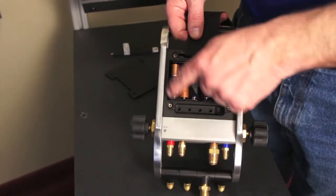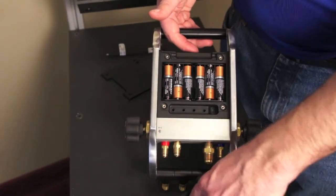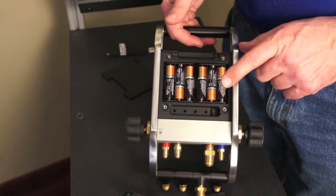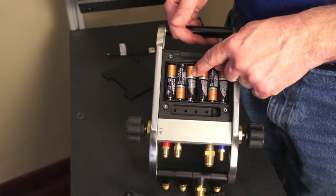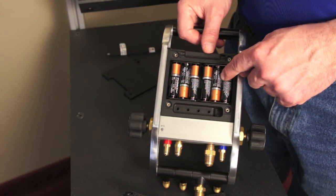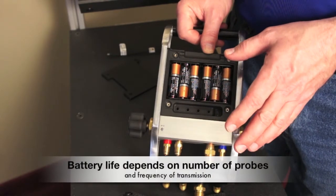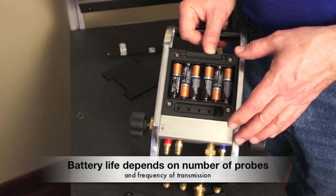After removing the four screws in the back we get access to the battery door of the iManifold, where we can take the hook out or change it by sliding out the rod and sliding a new one in. The iManifold is powered by six AA batteries — though it actually only operates off 4.5 volts, with two sets of three batteries connected in parallel to increase battery life. Right now with six batteries we're running about 120 hours, and after some power optimization we expect that to improve further.